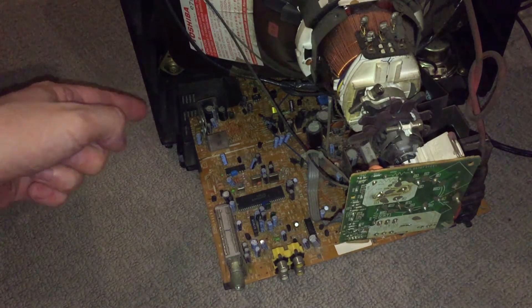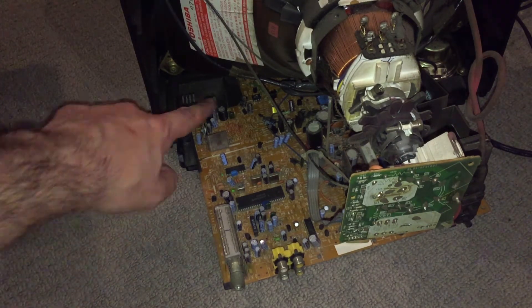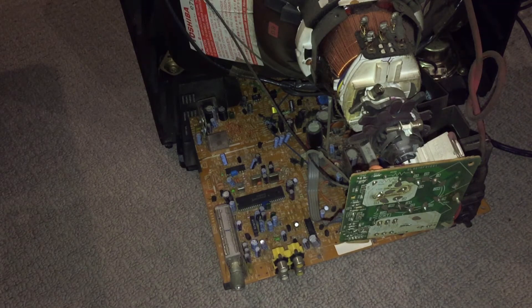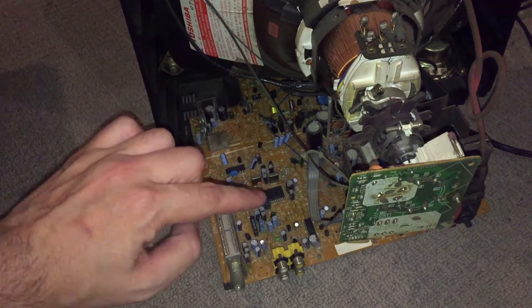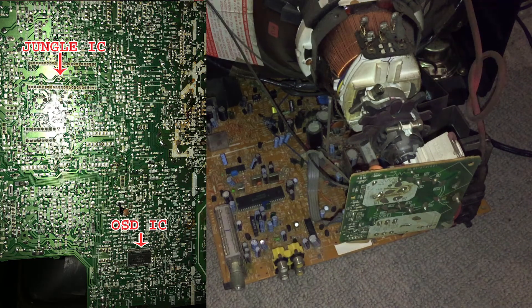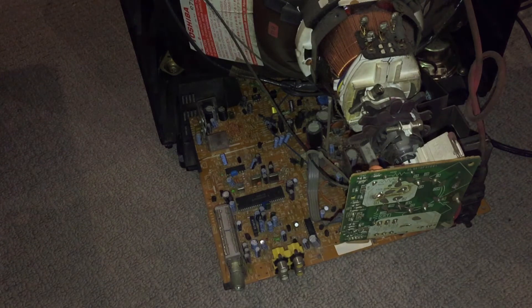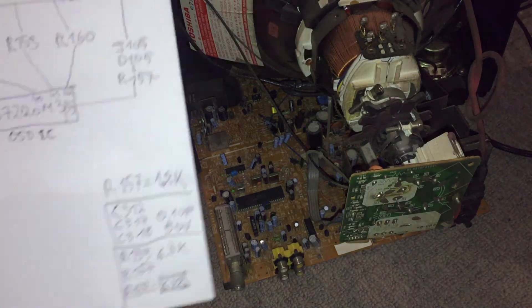There's actually a chip on the underside of the TV quite far over there — that is an SMD OSD controller. So what I did is I took my multimeter and traced those pins. It was quite hard because you're basically navigating in the dark trying to find points that beep. I traced it on a piece of paper, and I'm pretty happy with the results because I was able to make sense of how it's wired, and I think we'll be able to mod this TV set for RGB.